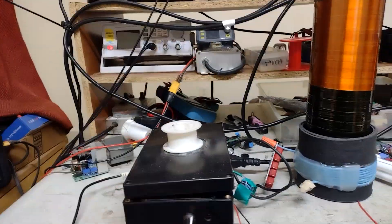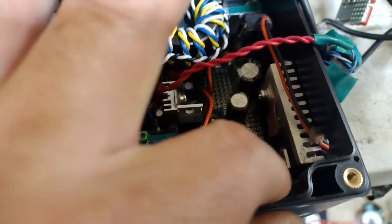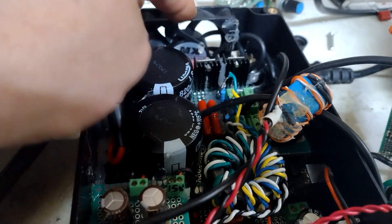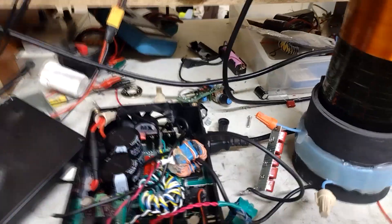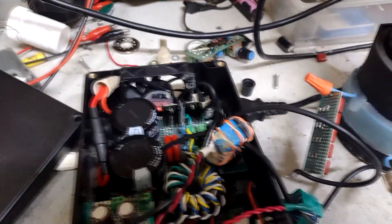Maybe it can even ground-strike. Instead of running two DC wires out, I'm going to have a small lithium battery inside powering a little boost converter — USB rechargeable — to drive the logic. The only downside is the fan, which is always on. Normally I have a thermal switch to engage it when things get hot, which I don't have here. That's something I'll end up doing — once everything's closed up, start tuning, run at max voltage, cut up the on-time, and see how long it takes for the fan to kick on as a bootleg way to monitor temperature.